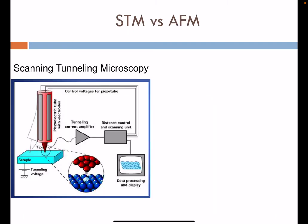To contrast the two microscopes: in the scanning tunneling microscope, piezoelectric quartz-type materials are used for positioning the tip over the sample. The sample needs to be grounded so that current associated with the transfer of electrons from the tip into the conducting sample can occur. This sample must be conducting for the technique to work. Electron transfer occurs from the tip to the surface as the distance approaches the nanometer scale, allowing tunneling of electrons across that gap and registration of current for mapping the conducting sample surface.